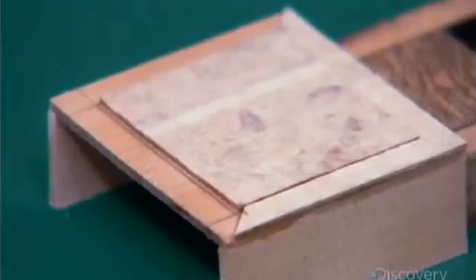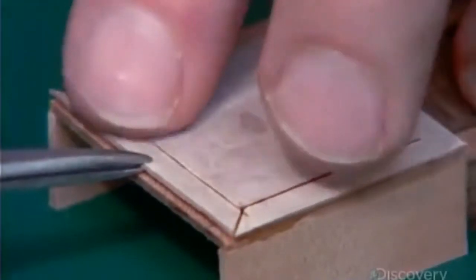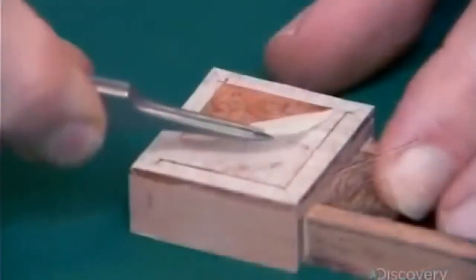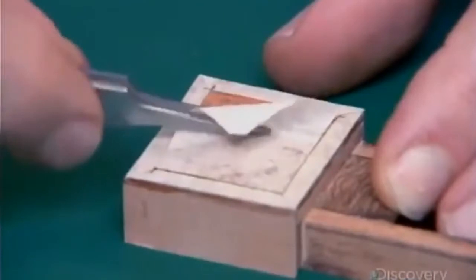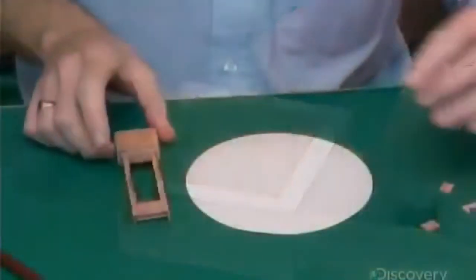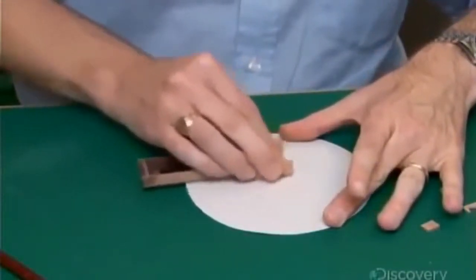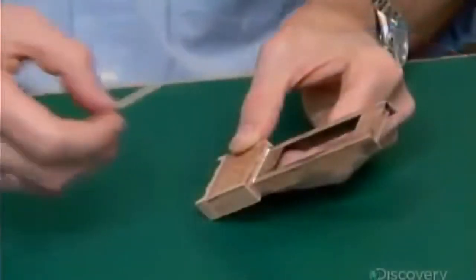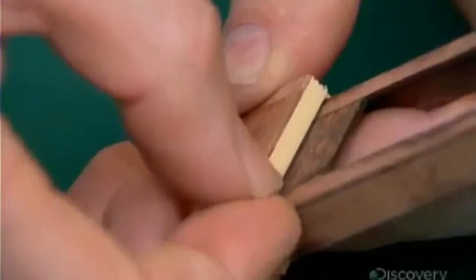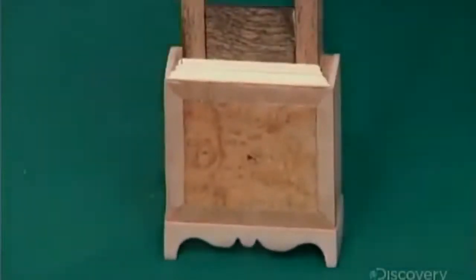He carves angles and trim to make it fit neatly around the paneling. He then peels away the tape to reveal the swirled burl of the veneer wood, which has been cut from the root of a South Asian tree. He rubs the paneling against sandpaper to smooth its surface and expose more of the wood grain. Once the feet have been installed on the clock, he applies a strip of molding above the trunk. The crisp profile of this lime wood trim is a classic touch.